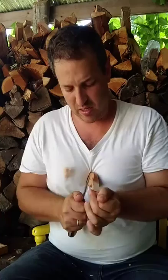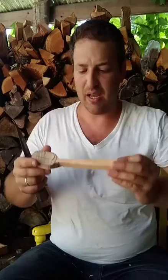You can make a cut that starts shallow and then gets deeper and deeper, and that will naturally, in just a couple of cuts, create that tail flip right there. It's just a natural part of carving down the spoon — it sort of wants to do that anyway.